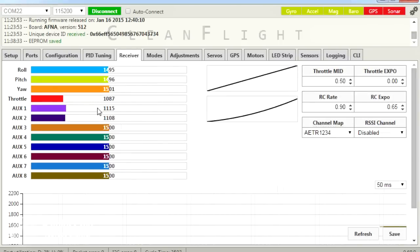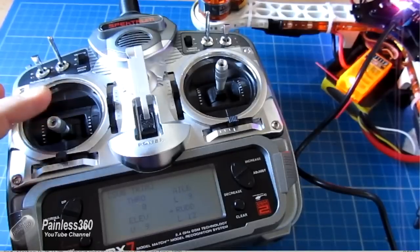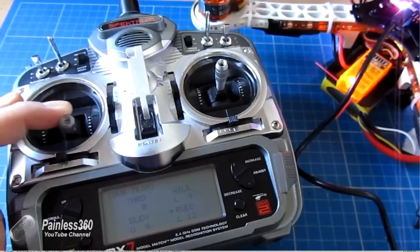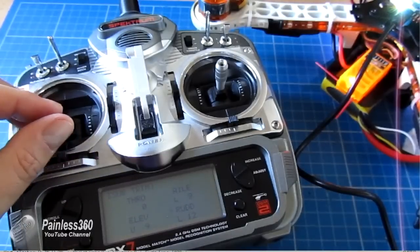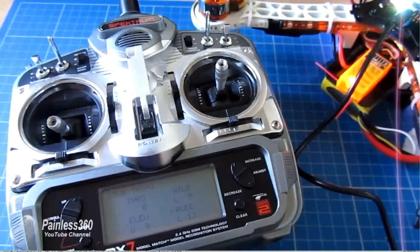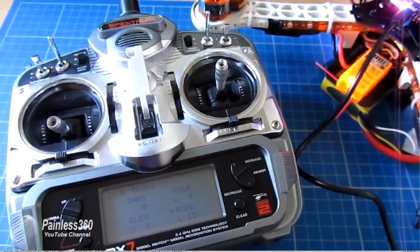Now we know the receiver is working, we've also double-checked that we can arm the board. You hold the throttle stick to its lowest position and right. You need to make sure the throttle value is below 1100 and that the rudder goes below 1100 and above 1900. Testing it: board is armed, throttle up — wonderful, the motors are starting in perfect synchronization. Disarm is the other way around. The arming process works, modes are confirmed, and the receiver is all set.